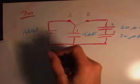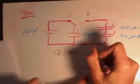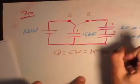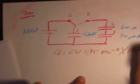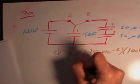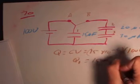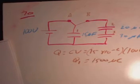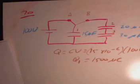That comes very simply from the core capacitor equation here, that Q is equal to CV. So if I know it's a 15 microfarad capacitor, I can write 15 times 10 to the minus 6. There's my 15 microfarads, and it's been charged up to 100 volts. And if I do this here, I'll get the Q on capacitor 1 right there to be something like 1500 microcoulombs. So there's the first result for you right here. When this capacitor is fully charged up, it holds 1500 microcoulombs of charge.